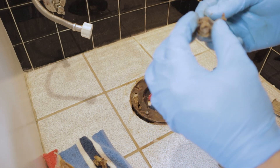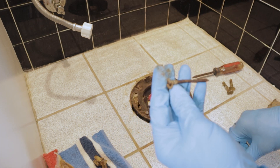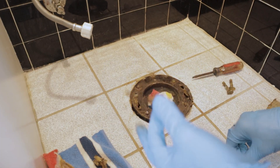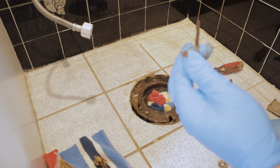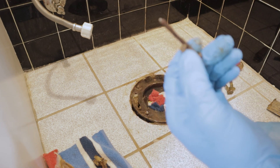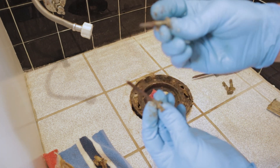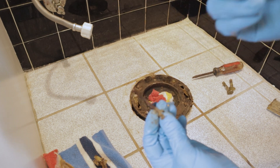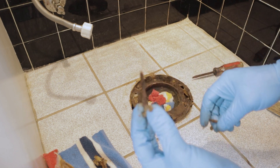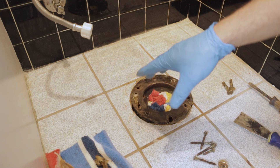This is exactly why it's very important to use stainless steel hardware when you put these flanges down. If you use regular hardware, even on a toilet that isn't leaking, you'll get condensation and sweating in humid summer months. These screws at one point were all the same length, but one broke off - which means I'll probably have to try to drill that out if I want to reuse these holes. We're definitely grabbing stainless steel hardware at the store.